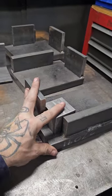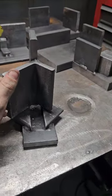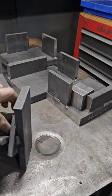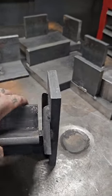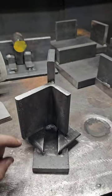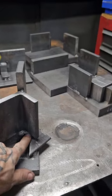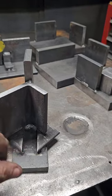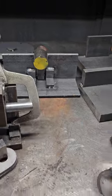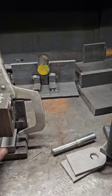This one is for all those small rings I was doing. The ring goes in here and then the pipe comes down, you clamp it, then tack it here, tack it here, unclamp it, spin it — and it stays in there. That way it has the proper height the whole way around. After it's done tacking, pull it out and do the next one.